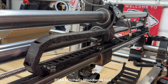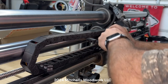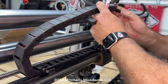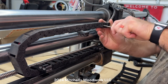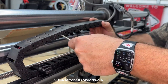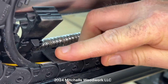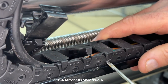Get it out of the way. We've got to get this drag chain off here. One of the first things I've got to do is take it loose right here. Now I just need to start popping those links loose. I'll show you up close how to pop those off — there are your top closures. Each one has that little slot underneath; you just take a small screwdriver in there and twist it and pop it right up.